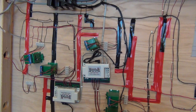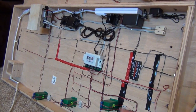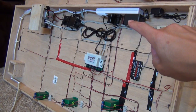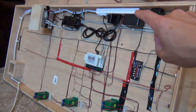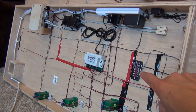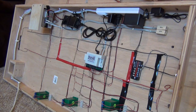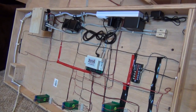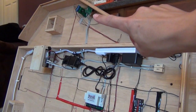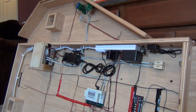Here's a quick view of the other half of the layout. My command station is up here along with a power strip, another DS-64, and the Woodland Scenics plug-and-play module for the LEDs for the structures. Right here is the switch that controls the plug-and-play lighting system. I have some turnouts down here, and my UP5 power supply is right there where I can plug in my Digitrax throttle.